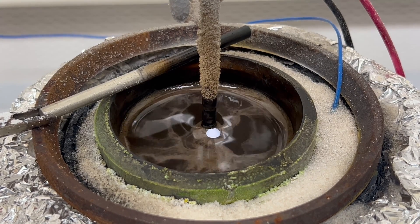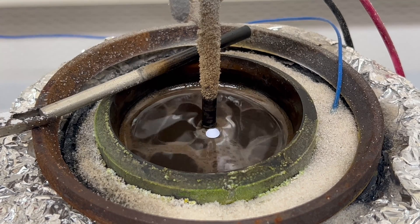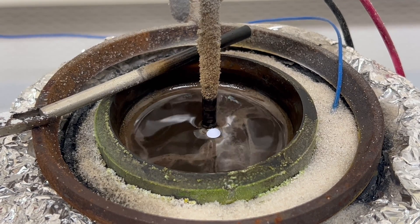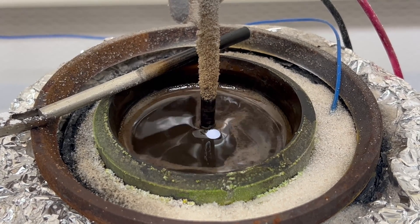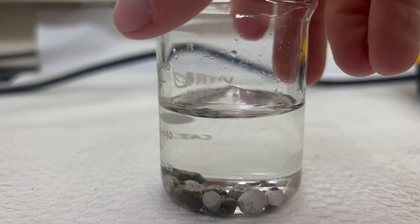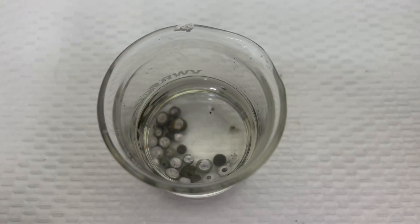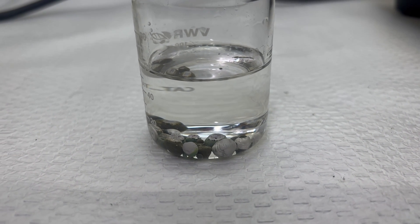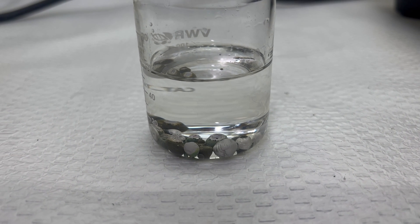By the end of testing, I found that for me the pipe cap and nickel rod as electrodes ended up working the best for sodium production. After about two hours of testing electrodes, we are left with a beaker of nice, dirty sodium metal. I could have produced much more sodium metal with all the hydroxide I had left — more time was needed. So this reaction is more of a time-restrictive reaction; you could produce a lot of sodium metal this way.